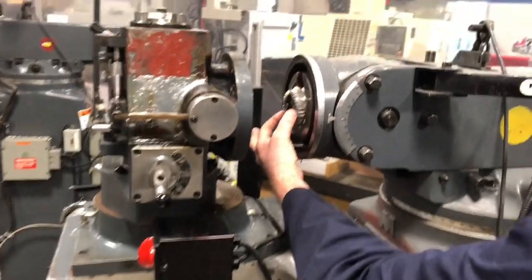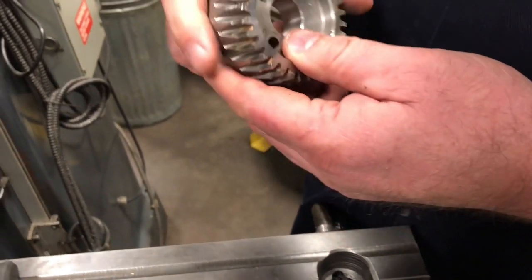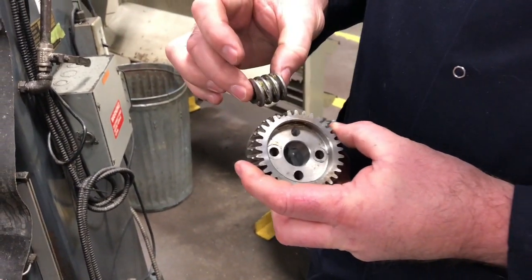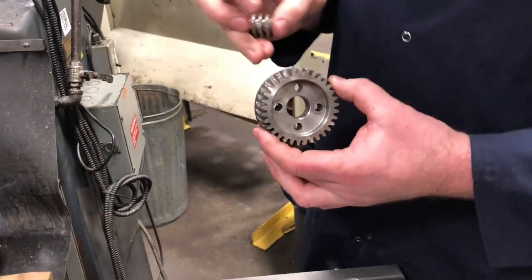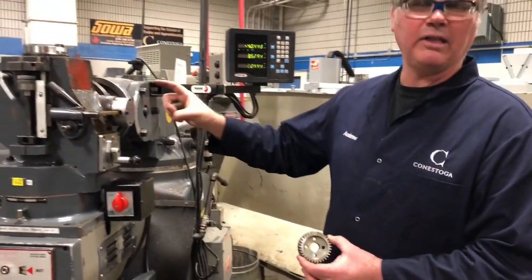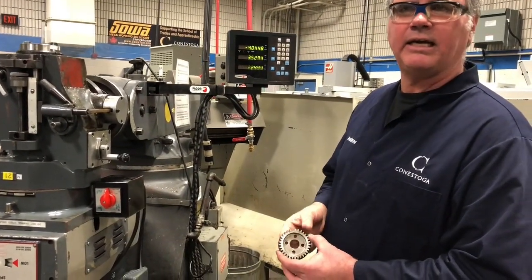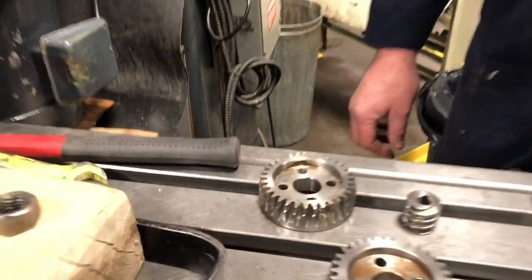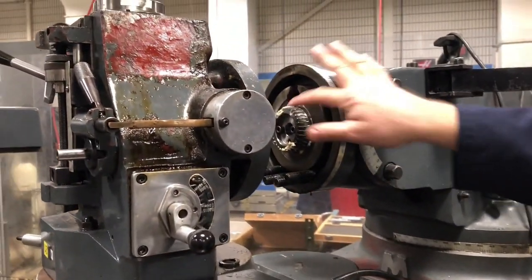I have access to this gear now for the repair. The problem with this damage is that I have a gear — it's basically a radial rack — and I have a pinion gear, and they lock in together. This is to adjust the head to zero. If students don't unlock the locking nuts and then force the worm gear, they actually break off the teeth of this gear, so you can't adjust the head of the machine to zero. So what I have to do now is separate the head from the boom and replace the damaged gear on the end of the boom.